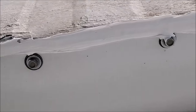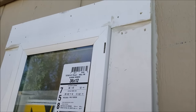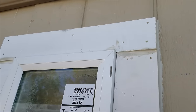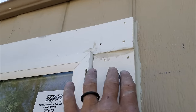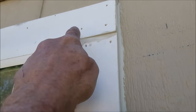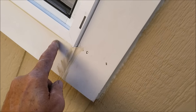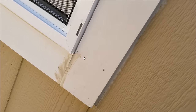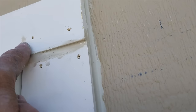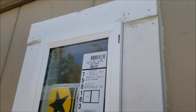Just showing you how to trim these — doesn't matter if it's a trailer house or a big stick house. Watershed: you want your top piece of trim extending past the bottom piece so water keeps flowing down. On the inside bottom piece, you want it tucked inside so water just keeps going past. You don't want to cut it across so it fills up with water, and don't angle it up on a 45 because it tends to collect water. That's how you trim out a window.